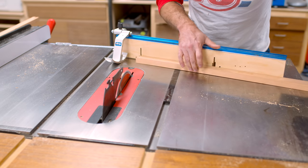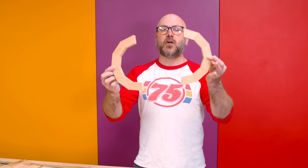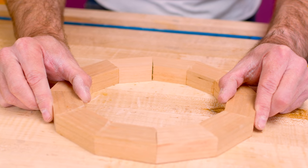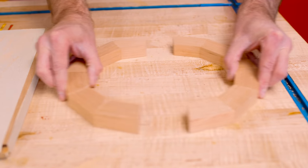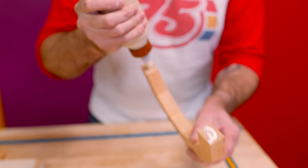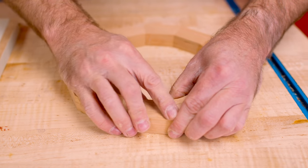This is a great one for wood turners or anyone who needs to cut segments. If you have an even number of segments, glue them up in halves instead of all at the same time. Getting the precise angle is really hard, and even if you're off by just a fraction of a degree, it compounds over all those segments. A great wood turners trick is to do them in halves — sand both halves flat and they'll fit together perfectly with no gaps.